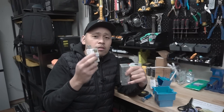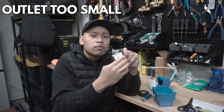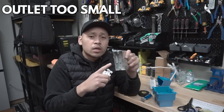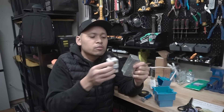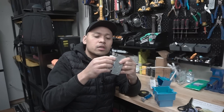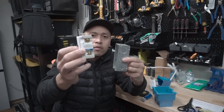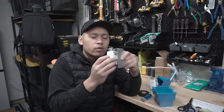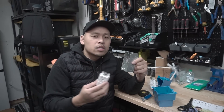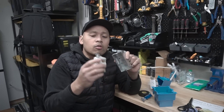Another reason is because your outlet — let's say this GFCI receptacle — is too large for the J-box. Sometimes these J-boxes are just so small, and we fit the outlet in where it's super cramped. Given a small one-gang box and a huge GFCI with all the wires crammed into that one space, there's definitely a chance that one of the wires could be touching the box or the terminals on the outlet and create a short or spark.